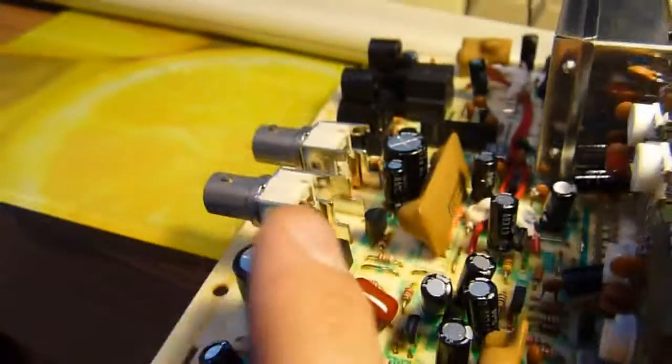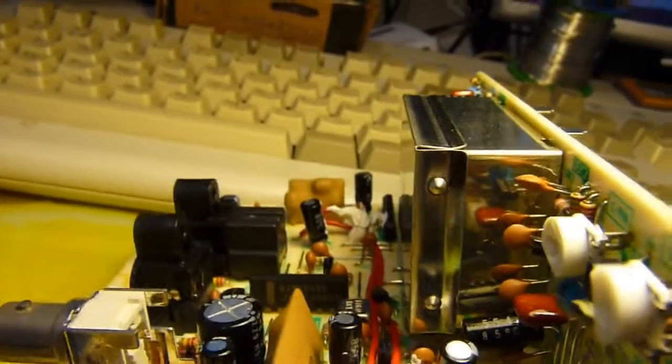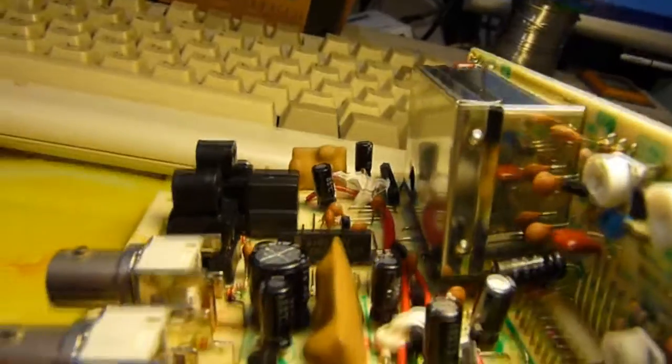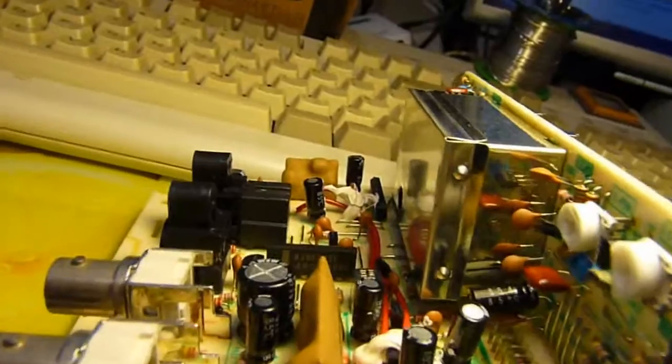We were looking at these, which were the superimposed dB output buffer doohickeys. Well, now we're on to the next one, which is a NJM2245L, which is pretty much the same thing, just only labelled 3 input video switch with 6 dB amplifier. That'll be for the S video. Pretty much the same thing, probably slightly less glorified because it doesn't have the overlay doohickey thing superimposed. What you would call it.